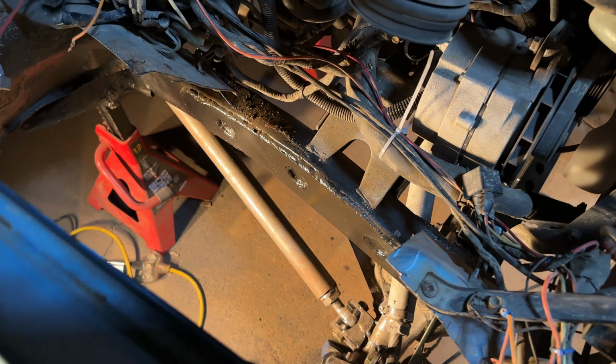It's been a little bit of a challenge to try to get this in here and to get it fitted with this axle side mount, because I do have to hold the shock up in the proper orientation. So I think the next logical step is, although I think these are good enough, they're in the ballpark, I'm gonna cut out the proper quarter inch piece of the air shock mount, because right now I've just got this cut out of 16 gauge sheet metal. So this was great for mocking it up. I need to move this cutout down by an inch, but it looks pretty good on the first pass.